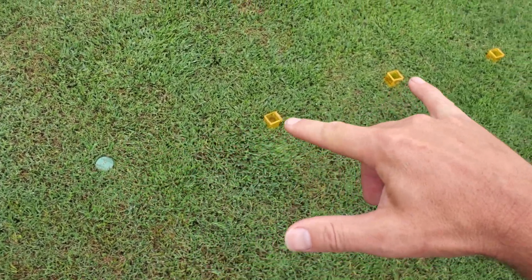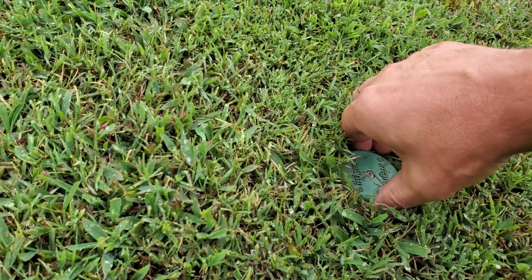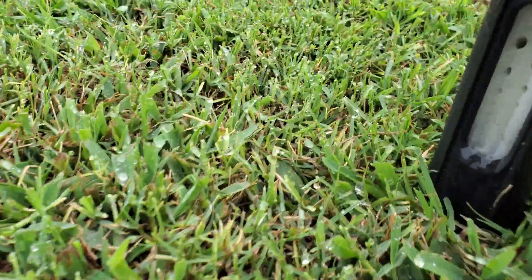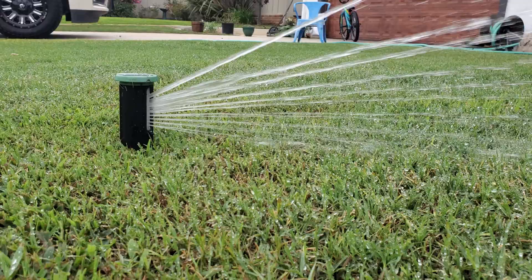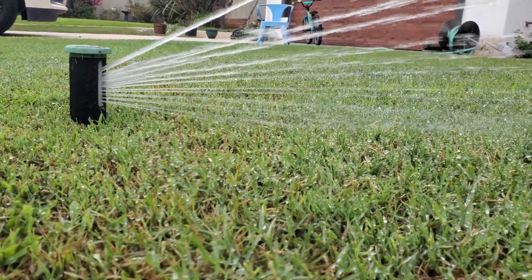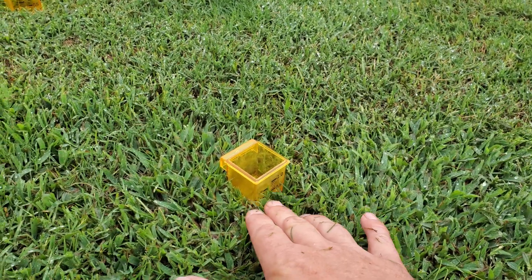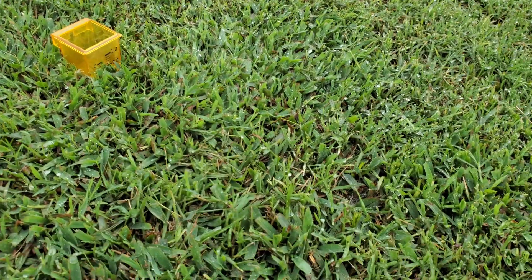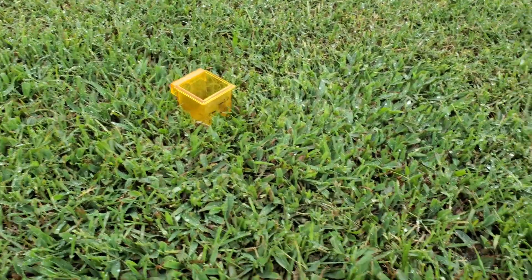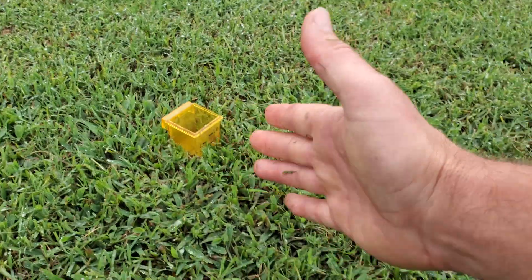I've got a cup there and a cup there — it goes all the way out to the road. Because the holes at the bottom are so low to the ground, I'm trying to put my first collection cup as low to the ground as possible for accurate collection. This one might not collect the expected amount simply because it's up above the ground — our margin of error is going to be higher here because the water is traveling closer to the ground. It might not get up over the lip, but we'll see.